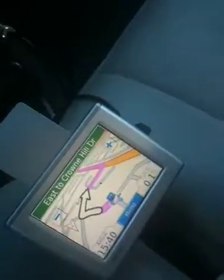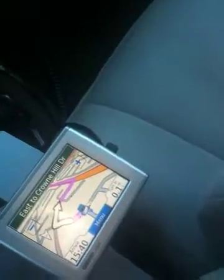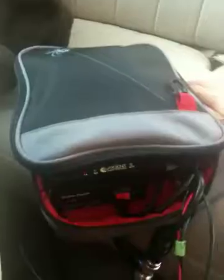Not much invested — all used parts. You can get one of these for $20 or so on eBay. The OT-2M is still available — a nice little tracker from Argent Data. The HTX-212s or 202s are available easily and they're nice little radios for building a little project. I just picked up a little bag, buttoned it all up, mag mount on top, with a short coax cable to a barrel connector. This can go anywhere — a rental car, a different vehicle. You can even just put a rubber duck on the antenna if you want. Good APRS system on the cheap.